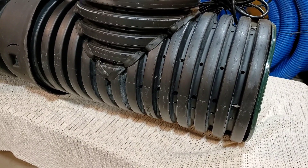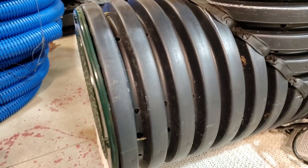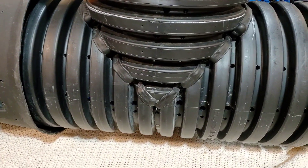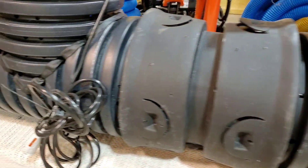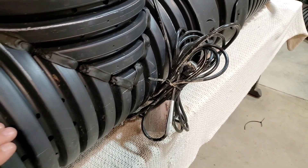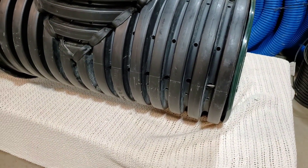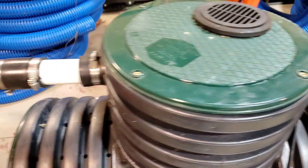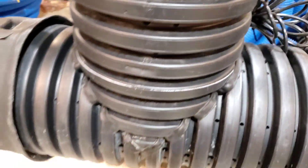After 35 years as a contractor, I never used an indoor sump basin for an outdoor yard system. What I discovered is that going deeper and wider in diameter wasn't the answer. The answer was an extended chamber — a really nice long chamber — so the water can come up and when it turns on you have this entire chamber holding tens and even hundreds of gallons of water. This is very significant to the longevity of your yard system. If you want minimum maintenance, the key is in the switch of the sump pump.